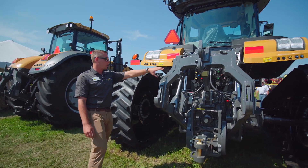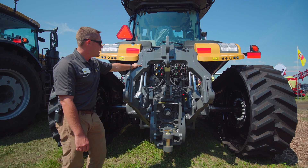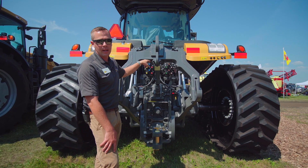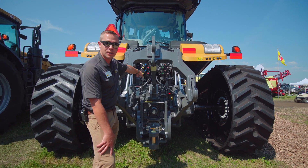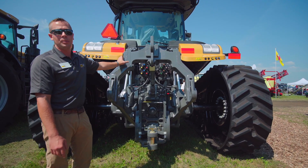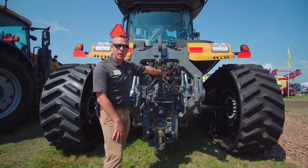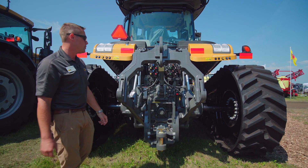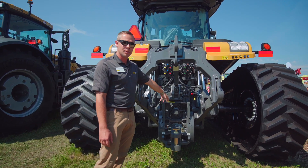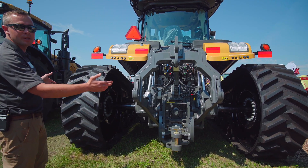Looking at the back and looking at the hydraulics — that's changed up as well. This machine has a 58-gallon-per-minute hydraulic flow. The 58 GPM covers all six valves. If you go to high flow, that's going to be two 58-gallon-per-minute pumps: one pump controlling your left three valves and the other controlling the right three. That's really going to help in planting applications where you want high-pressure circuit on one side and high flow on the other — you can move them around to make your hydraulics more efficient. These tractors also come with a three-point standard as well as a 1000 PTO, and this is a wide-gauge machine, out to 120 inches on center.